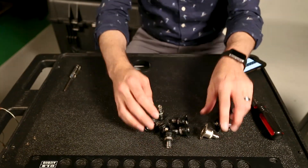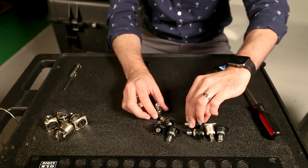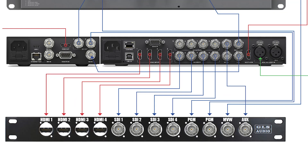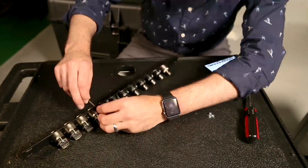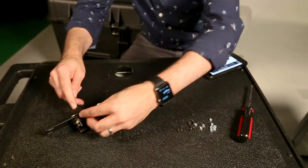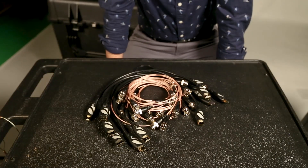For this next panel we're going to have four HDMI and eight SDIs. Eight SDIs — that's going to be the four inputs, two program outs, one multi-view out, and one aux out. The next step is putting those panels in the back of the rack and then running patch cables everywhere they need to go.